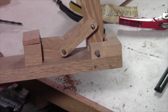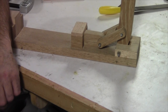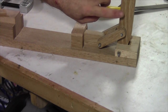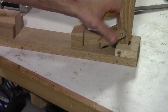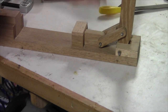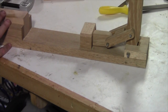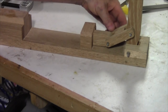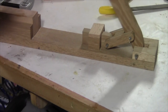One thing I did just now was make sure my hole placement was fine, but on the actual handle I wallowed out the hole a little bit — not on the link because I want the pin to fit tight in there, but I opened it up a little bit more for the link. That way I get a nice press and stay pretty much down on my base. It's going to take a little while for the pins and links to wear in — a little bit of wax might help on the links to get your movement, but you can start using this thing right away.